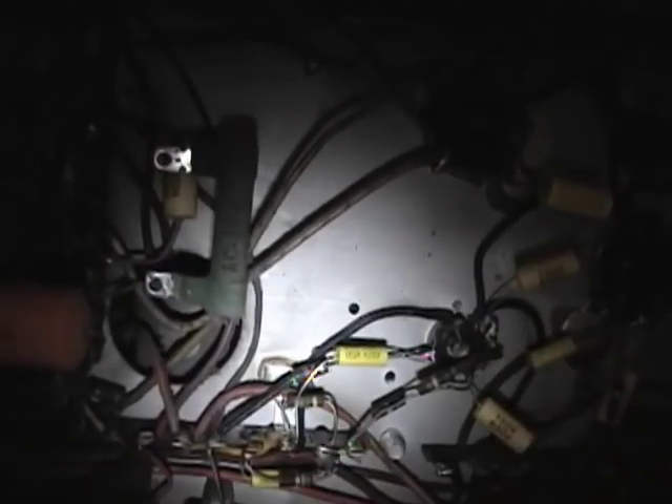After I replaced all the plastic wax caps, I powered it up and the fuse blew again, leaving one culprit: the three-section electrolytic can cap. Usually electrolytics are the first to go, but because the other electrolytics in the power supply and audio amp seemed okay, I thought maybe it had been replaced. What I did was leave it in place but removed the connections below and tacked in three modern caps to see if that solves the problem. Once I get this side working, I'll gut the old metal can and stuff the three caps back inside for a neater job.